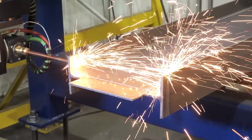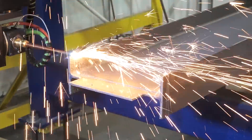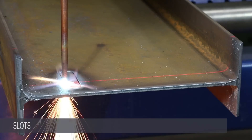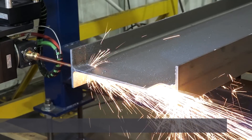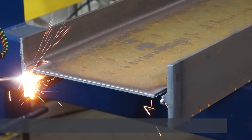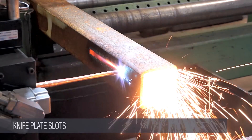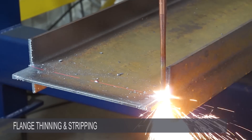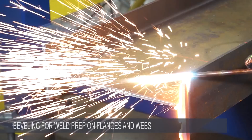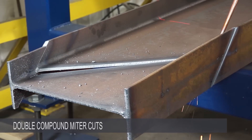The Ocean Liberator is able to perform all simple and complex copes and cuts, including cut-to-length, mitre cuts, slots, fillets, end copes, blocked ends, rat holes and moment connections, mechanical cutouts, dog bones, knife plate slots, flange thinning and stripping, and more. It will also do beveling for weld preparation on flanges and webs, and even does double compound mitre cuts.